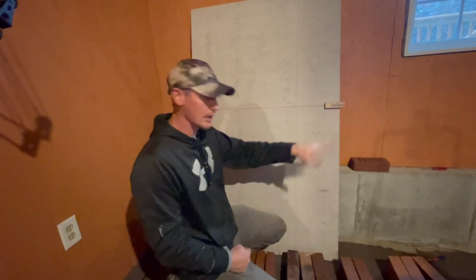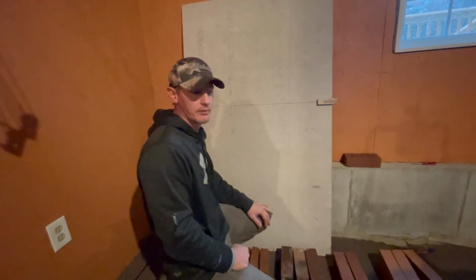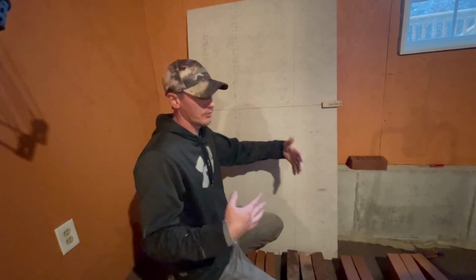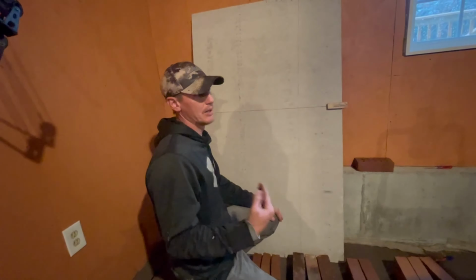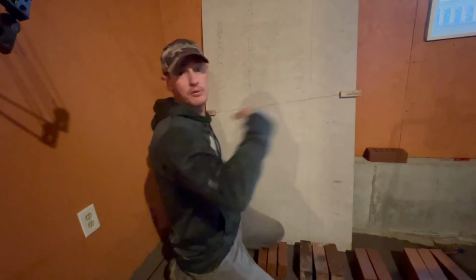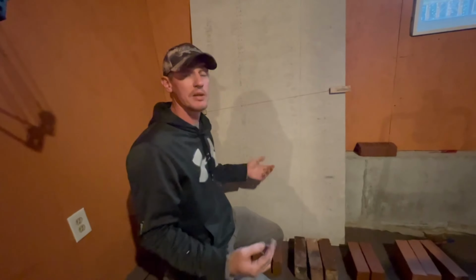It was a brick shelf just like this, and I laid a couple courses in, and it was feeling really funny. We were kind of in a trench, so I stood back a bit, and it just looked funny. The problem was the foundation was off so much that we were on different courses. It was less than a 30-foot run, but we were on different courses because the foundation in that distance was off about 3 inches.